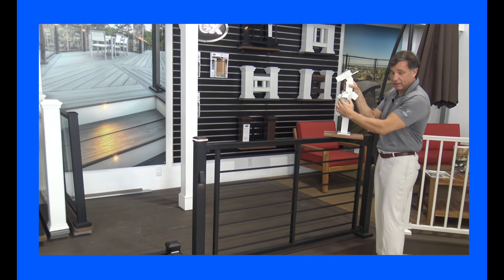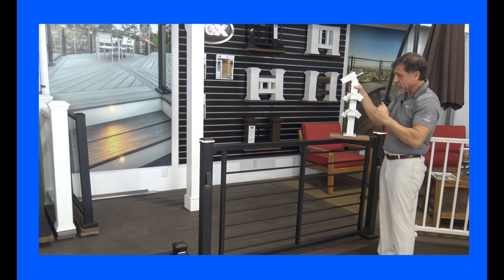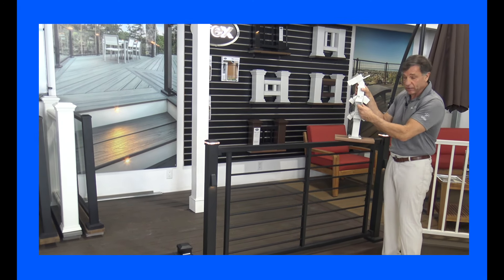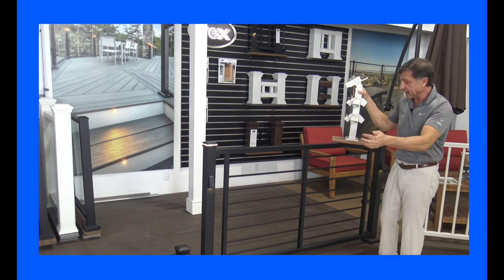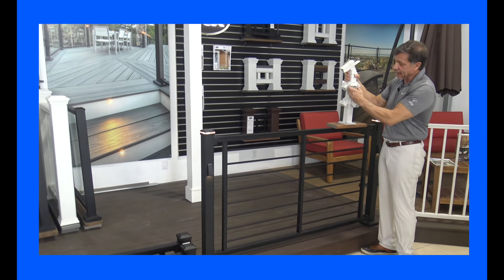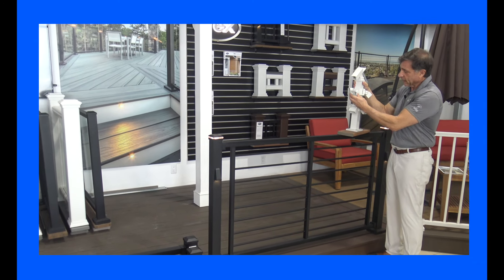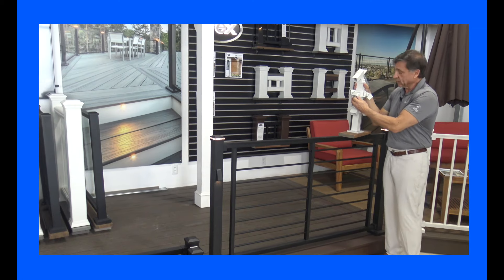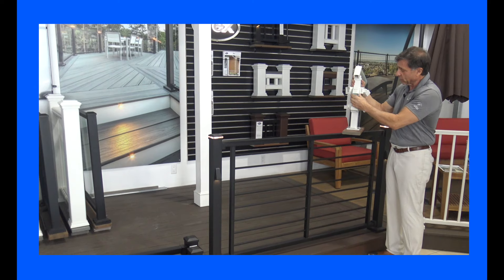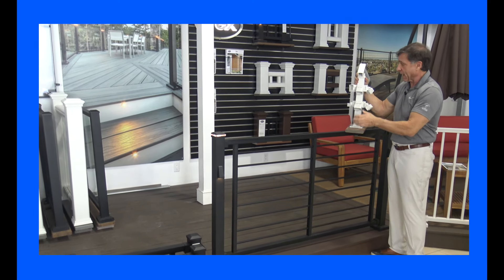With the compound swivel stair rail you can go left to right and up and down. If you have an odd angle on your stairs and you want a deeper tread width — sometimes you could put three or four pieces of decking on your tread — you would need something like this. And if you didn't have the odd angle but wanted a different rise and run on your stair, and you were directly 90 degrees from your deck, you could use a swivel bracket or a swivel stair bracket.